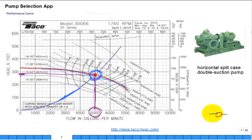So you have your pump there. You're thinking about the head gain, or the pressure, that's called the head gain across a pump. And this is the head loss around the loop. They are precisely the same at that operating point.